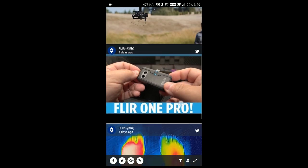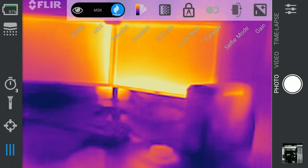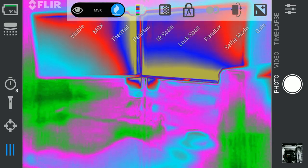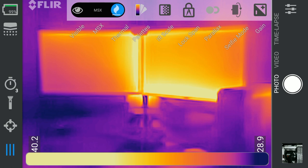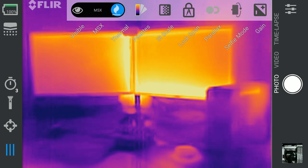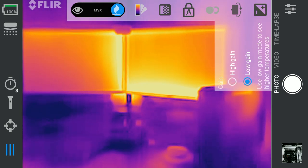Let's get into the heart of the app. When you click on the mixer icon, MSX allows you to switch between the visible and thermal images. The palette icon opens up nine different thermal backgrounds, including rainbow, lava, hottest, gray, arctic, coldest, iron, contrast, and one called wheel. The IR scale gives you a color range scale on your image to help you determine hot and cold spots. Lock span locks the color range of your image. Parallax is supposed to allow you to adjust the distance between the camera and the image — unfortunately, it didn't work for me. The gain setting allows you to switch between high and low gain settings depending on how hot the object is that you're looking at.